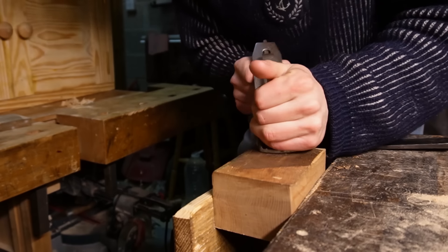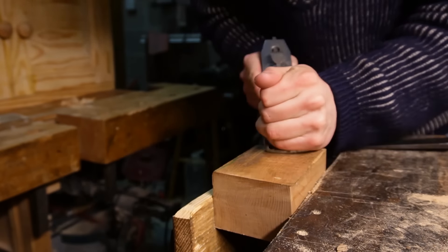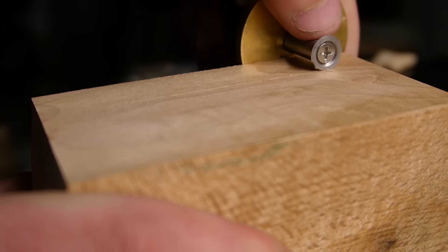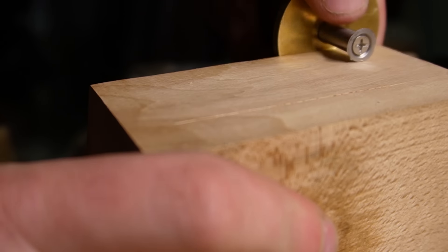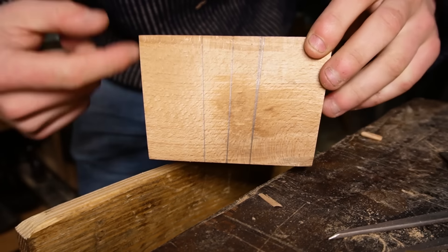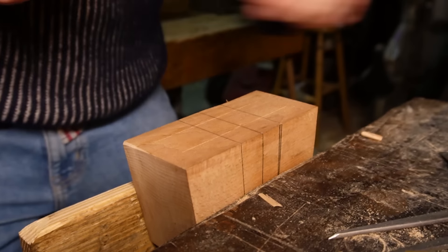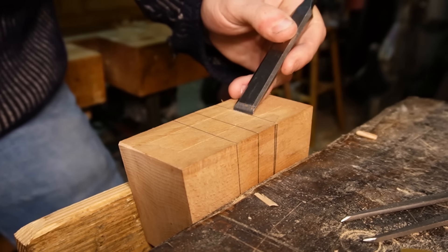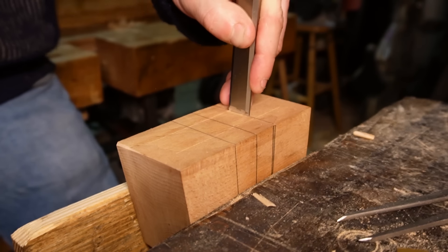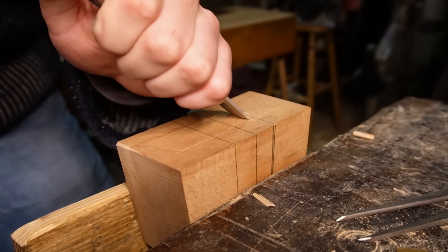There's a bit of patina on it just because it's so old. So I'm going to chuck it into the vice here and grab the Stanley number three and just shave all of that right off. That to me looks like a patch of green — however that happens. So I'm just using the marking gauge here to mark out the mortise that will eventually take the handle through. It's tapered so that the bottom is narrower than the top. Before I bore the hole the entire way through the mallet head, I'm just going to come along with the chisel again and just mark out the shape of the mortise.